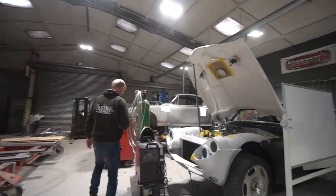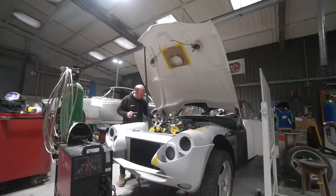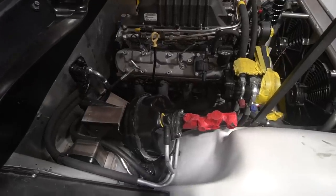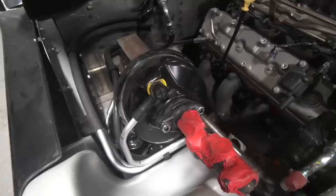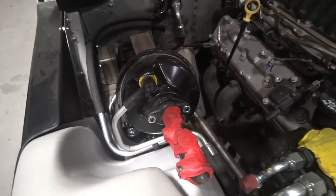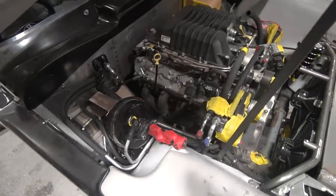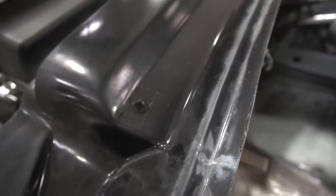We're going to walk past Jensen's CV8. Bobby's been doing some beautiful work on this - some tube shaping. He's been working on shaping up aluminium tubes and doing some flexible pipework for getting the vacuum feed to the brake servo, getting that all done neatly and making it all look like production car stuff, which he's done a lovely job of. He's now got the washer jets installed - made the little brackets to hold them, got them in, tested them, all done.